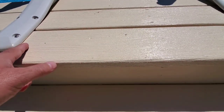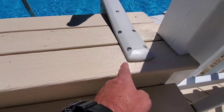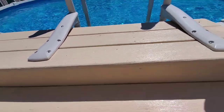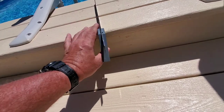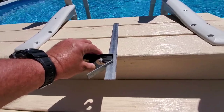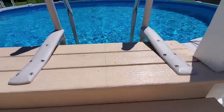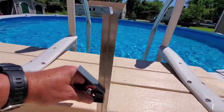I'm gonna leave a quarter inch over here and a quarter inch on the other side. This is 22 inches total, so 11 inches will be our center. All we got to do is transfer that mark. We'll make a mark right here and make sure it's square. Now we have our mark — that's gonna be our center mark right there.